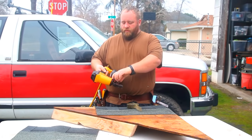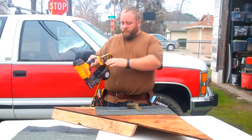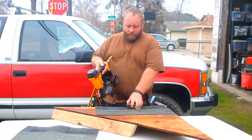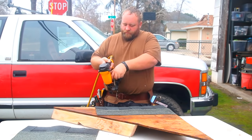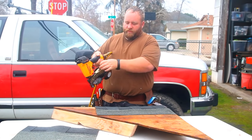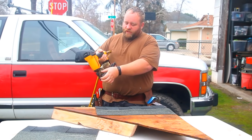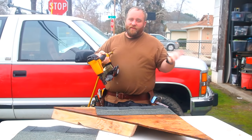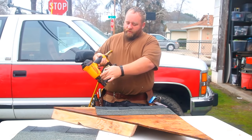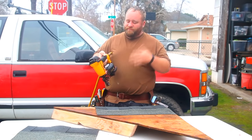Second, the loading sequence on the gun. I can open up the whole entire chamber and load it without having to have double doors — that's why I like this particular gun over all the other guns I've ever had, and I've had tons of different guns. You drop them in. It also has an adjustable shuttle which can be twisted and brought up and down for different size nails. This one only has two spots: anything above inch and a quarter and anything below inch and a quarter. So you'd only set it twice, which is really nice. Once you've got it in there, you lock it in, close your door. The whole thing loads with one door.